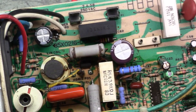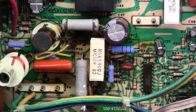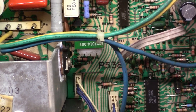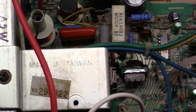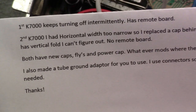The fuse is dirty, so we can take this out and clean up the ends. This is obviously the one that doesn't have the remote board because all the pots are on the edge. P538 is definitely the 25-inch version. This is the one with no remote board, so this is the one that had the width too narrow and fold over.